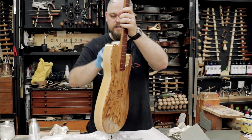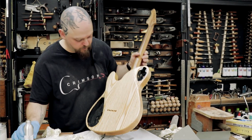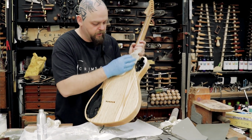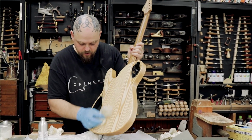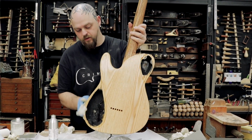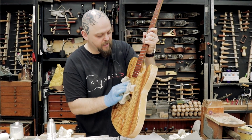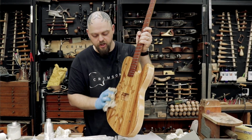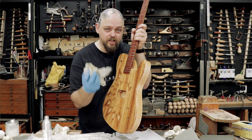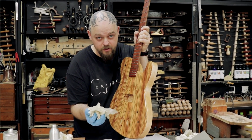The time varies, as I said earlier, depending on how warm it is wherever you currently are. I know many of you are in cold, dreary, fluorescent light lit sheds, and I apologize profusely. But if you're in a nice warm workshop, then it generally takes about 10 minutes or so to start setting. And the trick really is to not leave this rag unattended. When you finish with it, it will catch fire. Seriously, this isn't bullshit.